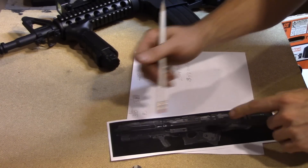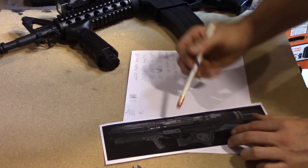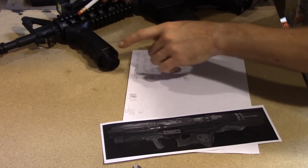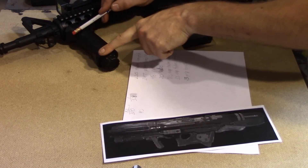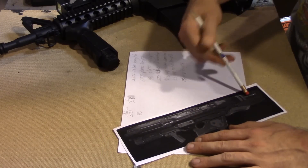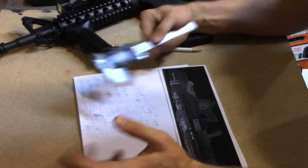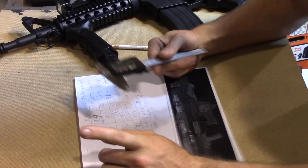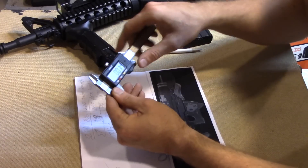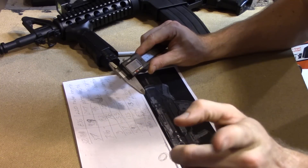To double-check, I need other known reference points to confirm my ratio is correct, since the shoulder-to-trigger measurement might not be perfectly accurate. The foregrip length is 23 millimeters in the picture; multiplied by 3.8 it comes out to about 85 millimeters, which matches the actual foregrip on the rifle — so I know the ratio is right. I screwed up in my explanation — I didn't actually show using the calipers first. I measure with the ruler first, then go back and verify with the calipers, because they always say measure twice, cut once. The calipers are much more accurate for getting final dimensions.